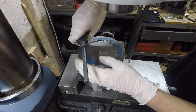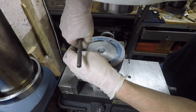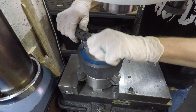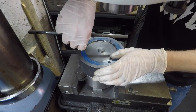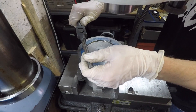This is where I added making a tap follower to the list of things I want to do. It was painful to get the tapping done with it slipping, and painful to watch afterwards. I don't have any bottoming taps, so I made the holes a little bit deeper to accommodate for the lead-in on the tap.